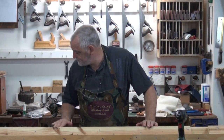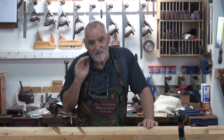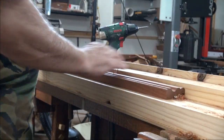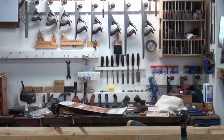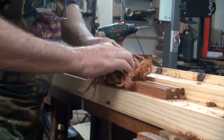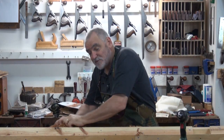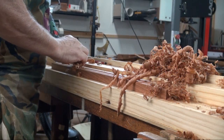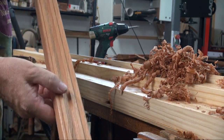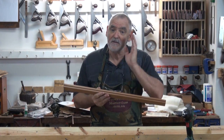And there you have it — a moulding made with three planes. But you won't see the real effect until we cut it and put it together in a mitre. Great thing about this too: rarely do you need sandpaper. Reach down, grab a handful of shavings that we created. I'll rub half of this and not the other half so you can see the difference — it burnishes itself and gives it a really nice finish. It's all natural. See, that's got a bit of a sheen there. That's the end I didn't do — no sheen.